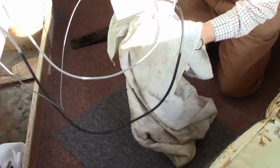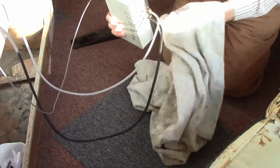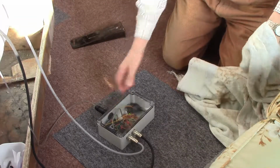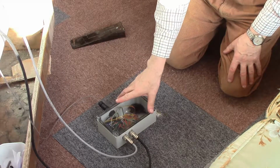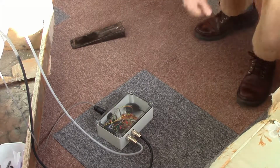I think the rudder movement now is due to the fact that the compass is on its side, which is not intended. It is tilt compensated, but it's not intended to compensate for an enormous tilt. Let me just put it down and see whether it stops. Yes, it does. Right. Now I'm just going to get something to blow air around the edge of that first.